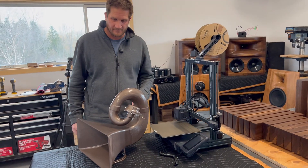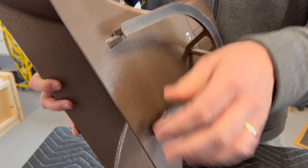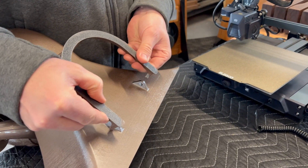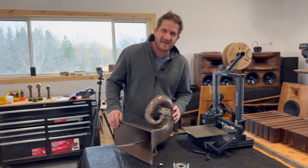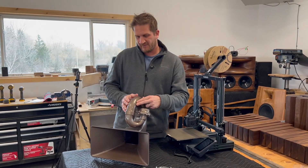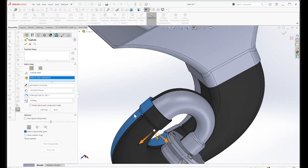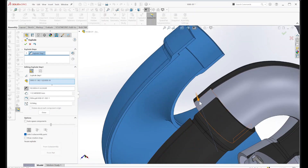Does the stand come as part of the printing or is it something I have to mount separately? The stand is a separate piece that gets printed and it just snaps on. I made it so that it spreads apart and you just put these little pins in there to keep it in place. Each elbow is in two pieces — a male and a female — so that you can glue them together. It also has a channel for your super glue to go into, which locates the pieces so when you put the two halves together they're fully aligned without fighting to figure out if they're lined up or not.